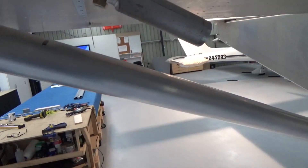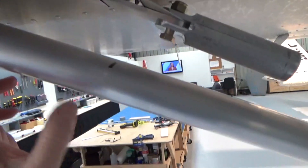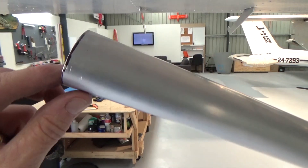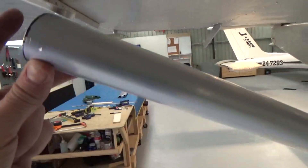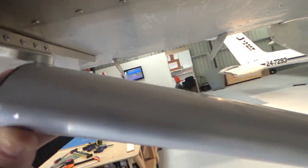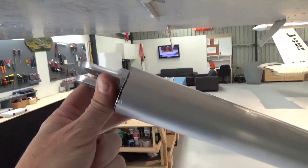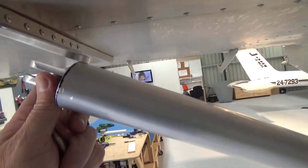Alright, offering up the struts. I'm going to have to do an initial cut just so I can get this up closer because it hits the wing. So I'll cut a chunk off and then make the accurate cut. Got the strut cut to length. Probably mucked around more than I needed to there. If you just connect the base off of this up, it needs to clear — I've got about a quarter of an inch still to go — so that you can actually insert this piece, otherwise you can't get it on. So that'll determine your strut length.